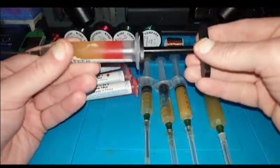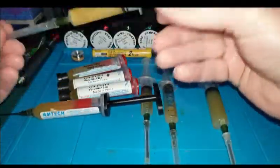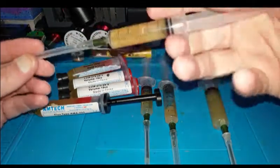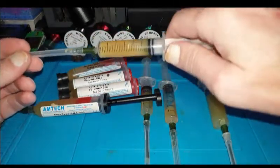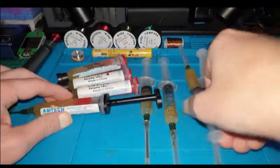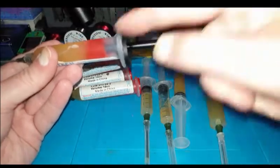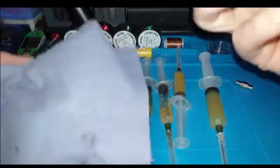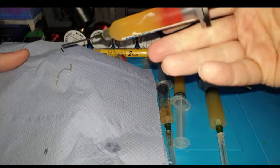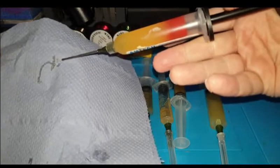The reason being: when you're squeezing the flux out, unlike these syringes, if you squeeze too much flux out you can pull back the syringe and hoover it back up. Also, when you're putting down flux, to stop the residual pressure pushing the flux out again, all you have to do is pull back up and it stops the flow. I've stopped squeezing and yet it'll still be coming out — it looks like a small amount, but when it's on a circuit board it can equal a lot.